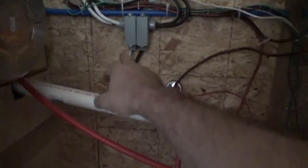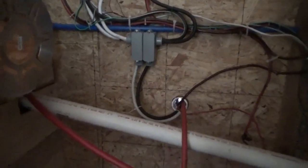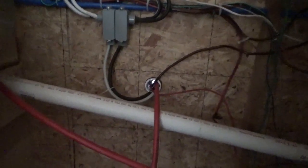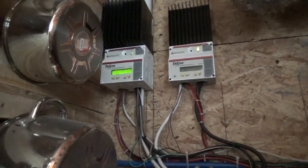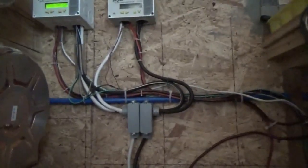I've shortened that wire considerably - it's less than 3 feet now, maybe about 3 feet. And then the same with this wire, it'll be about 3 to 3.5 feet long. I've really shortened the wires by taking it out from under the sink and bringing the battery bank and wiring over here. The 4-gauge is enough because all I've got coming out of the solar charge controller is a maximum of 20 amps at any given time. That 4-gauge wire will easily handle 20 amps over a 3 to 4 foot span.